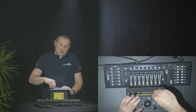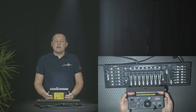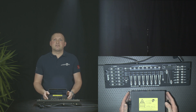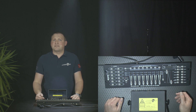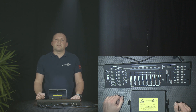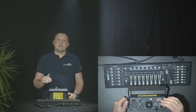You need to give each device inside one DMX universe an individual address. You can give the same address to several devices, but then they will do the same thing — or at least the same channels are triggered. If you give the same address to a laser and a moving light, it will be a weird situation because they do completely different things. So if you have a moving light and a laser in the same DMX universe, give a different DMX address to them. To ease the demonstration, I set the laser to DMX address number one.